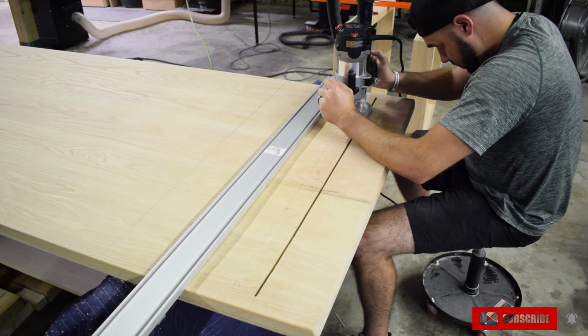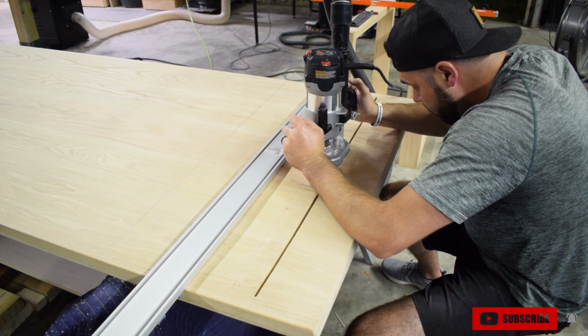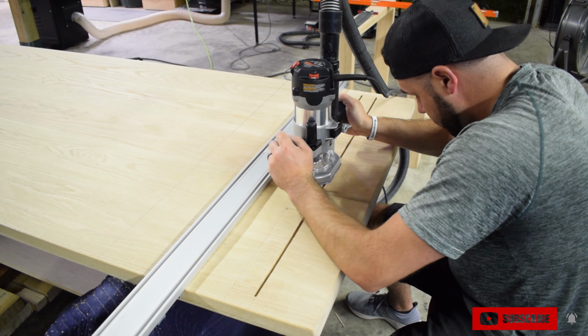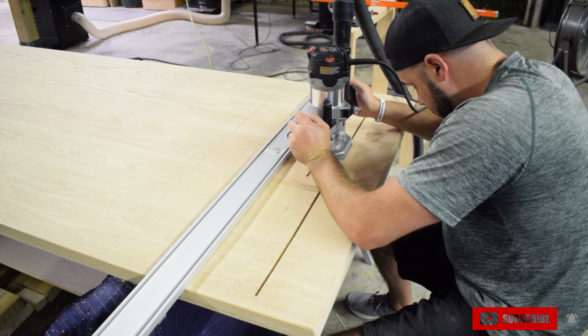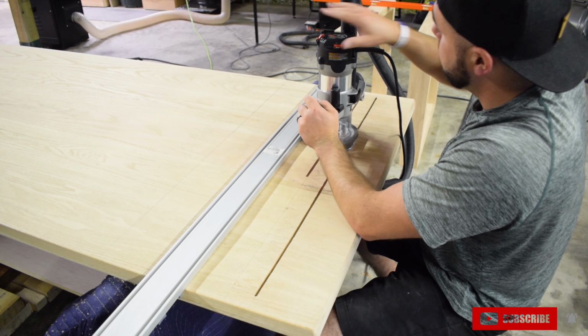For the initial C-channel groove, I used a 1/4 inch spiral bit with the help of a video from Jason at Bent's Woodworking. I'll be sure to leave a link in the description. I also used my Bora clamp as a straight edge for my Porter-Cable router.